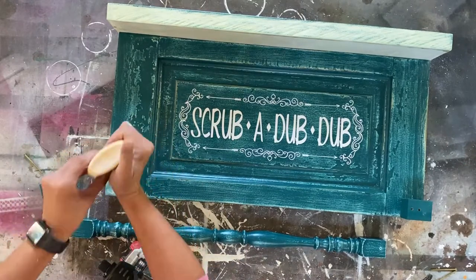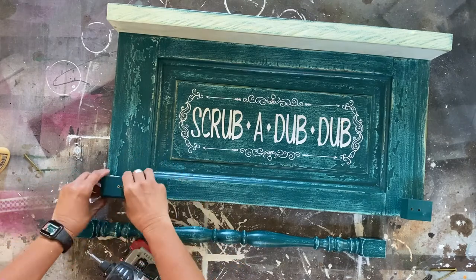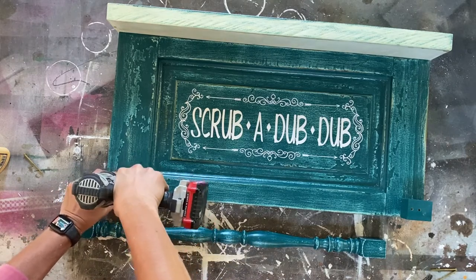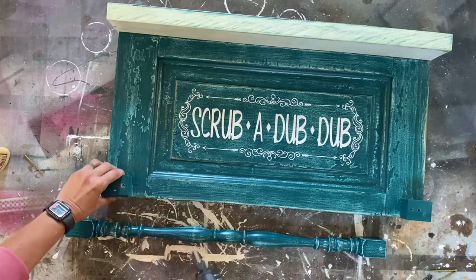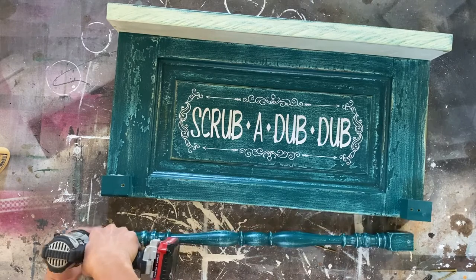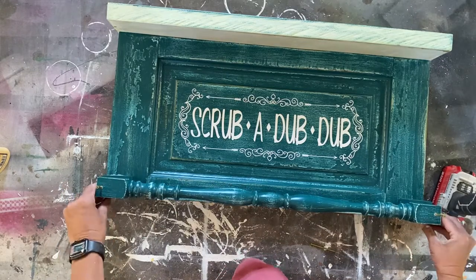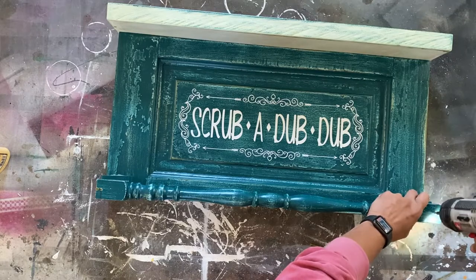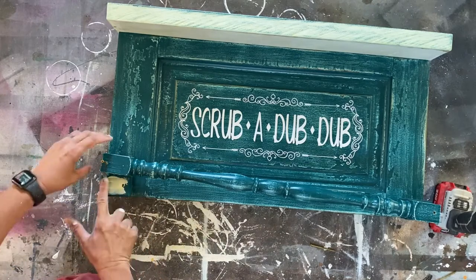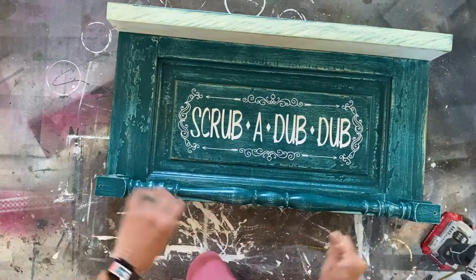This is the third attempt at the towel bar. I take my second two-by-two piece for the left side — the one I barely had enough paint for — pre-drill one hole, and install it with just one screw. I didn't press my luck with two. Then I pre-drilled holes in the ends of the spindles and installed them with the same two-and-a-half-inch trim screws. I forgot to put glue on the right side but added it on the left. No splitting, and it all turned out really, really good.